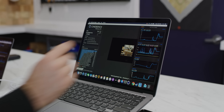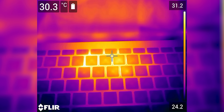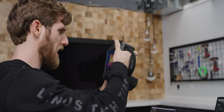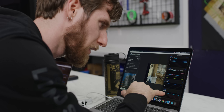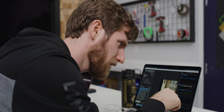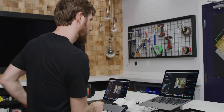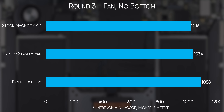Run number three — it's definitely going slower to reach 100 degrees. Package power consumption is higher than last time, but utilization is only about 87%. We did hit 100 degrees, so it looks like we are thermally limited. It's asking for 3.4 GHz — it's gotta know it's not going to get that. Result: 1,088. That's another 4%, bringing our total to about 8% uplift over stock.